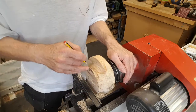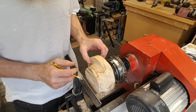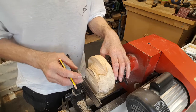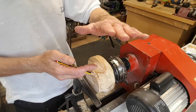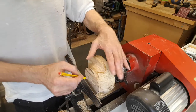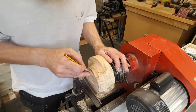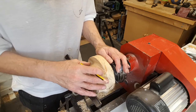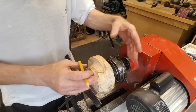That means I can get the bulk of the shape of this piece done without taking up too much room for the tenon. I'm going to shape this fairly rounded because when the piece is finished — due to the wing — I want it to sit and find its own balance point on its base rather than have a foot that it sits square on. We'll get the bulk of this outside turned along with the tenon. The final shaping of the outside will be done when we reverse mount this again after we finish the top and turn the inside of the bowl.